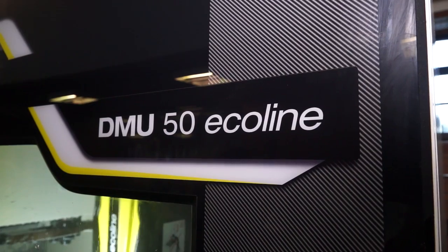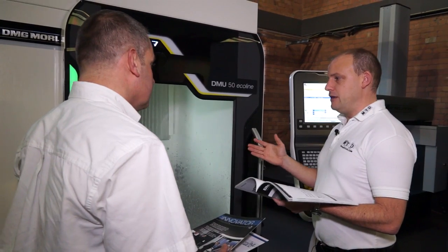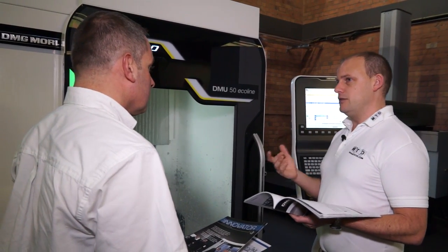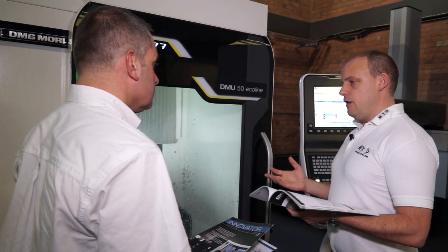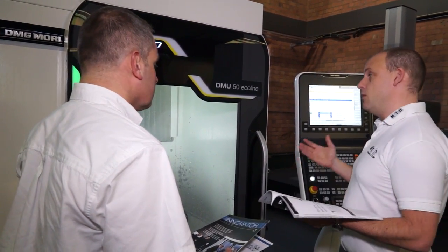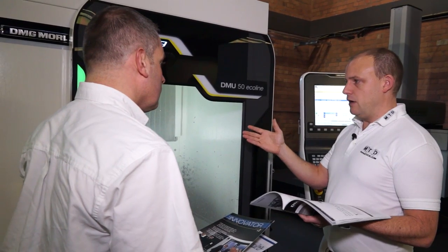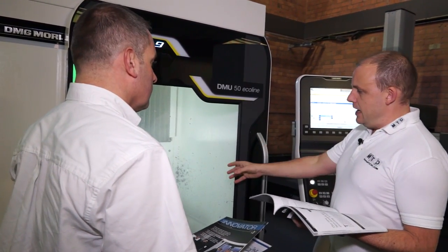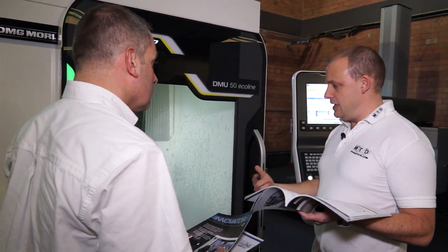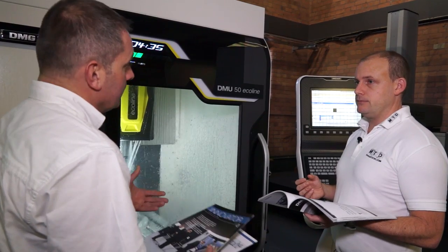I'll certainly be putting it on my list if I was doing the type of work we're talking about. I think they'll find that this will become a very popular machine for DMG Mori. The fact that you have a choice on the controls as well — so you can have a Siemens or a Heidenhain control — means that if you have been in a 3-axis arena and had a Heidenhain control, you can quite easily step up to a 5-axis machine with a Heidenhain control as well. Speeds — it's a fast machine. The spindle can go to 10,000 RPM and it's a quick tool changer. The Y-axis is actually a gantry type machine, so the Y-axis is independent of the X and the table moving as well. It offers all the characteristics you would expect from a 5-axis manufacturer.